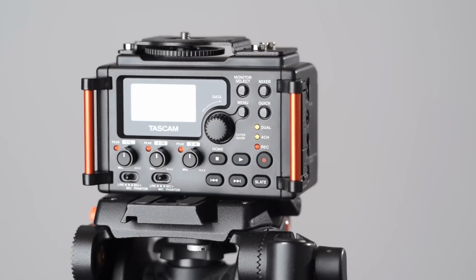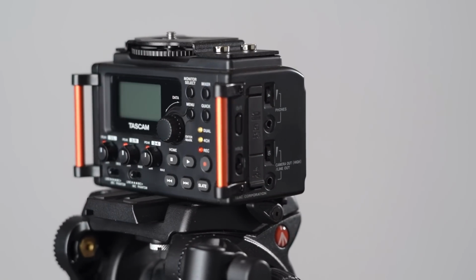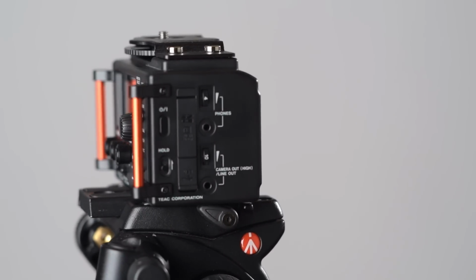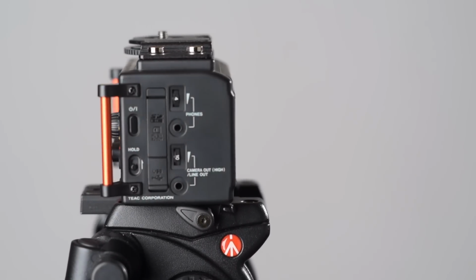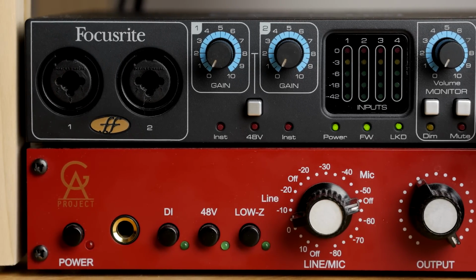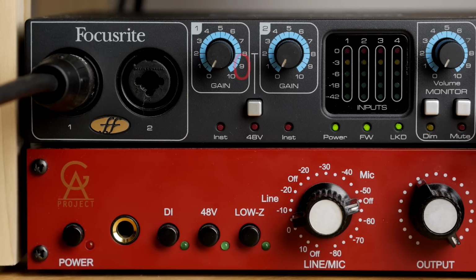What I found in these recordings, it sounds a little better recorded via the XLR connector if you have a decent high quality preamp or recorder or audio interface, whatever you're using. Though that preamp really has to have a good bit of gain to get a good strong signal because it is a dynamic mic. On my Focusrite Saffire Pro 24 interface, which is a decent mid-range audio interface, I had to record at a level of 9 out of 10, which left just enough headroom for laughs or louder passages, and then in post had to loudness normalize.